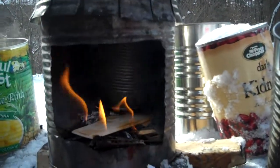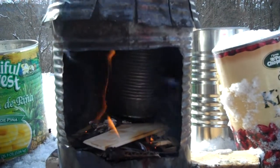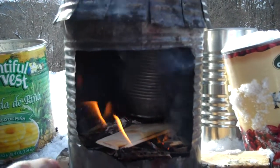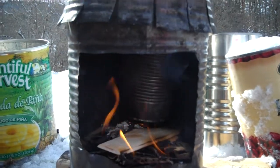And in the back of your combustion chamber we see a tin can. What's the purpose of that secondary inner tin can? Inside of that we've got sawdust, which we will bake into biochar, basically. And the gaseous emissions from that baking come out into the combustion chamber, and you hope to combust them.